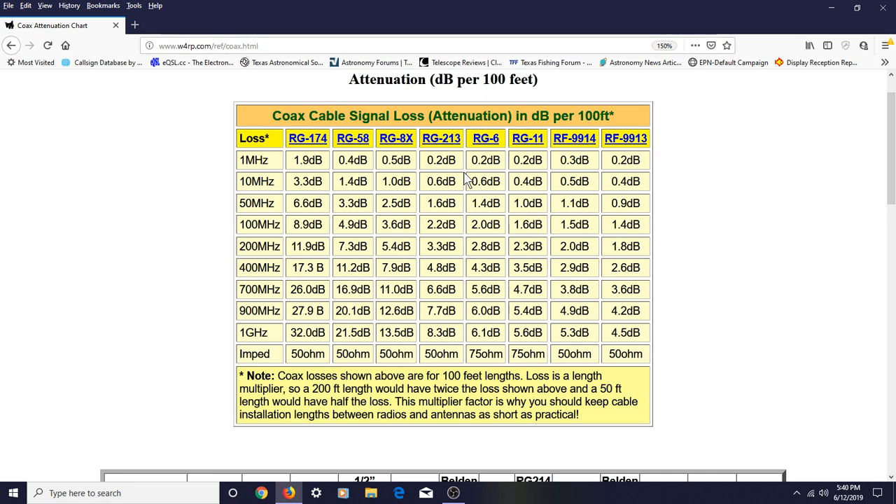If you're a tech and you're not working much HF, you're going to be operating in between those frequencies. RG58 — I call this the Radio Shack coax, they sold a lot of it. If you look at that, you're going to lose almost 5 dB at 100 MHz, 7 dB at 200, and 11 dB at 400. You're really impacting your signal. Even with just 50 feet of coax, you'd have a lot of attenuation going on.